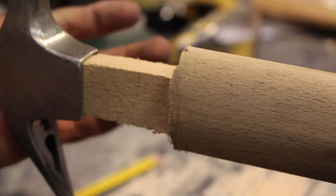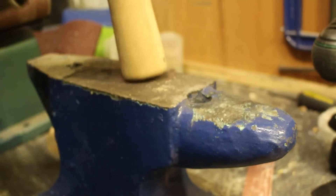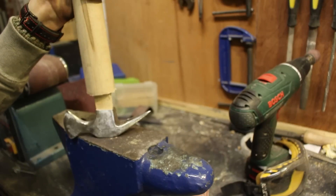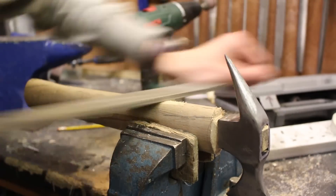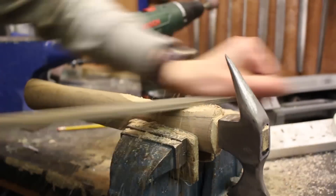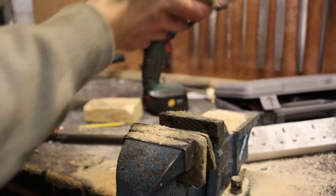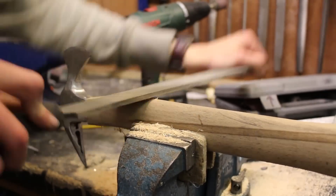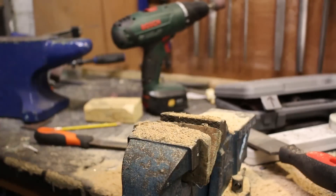I then began to force the hammerhead onto the axe handle. It's a really hard fit — very hard to hammer on — but that's good because it means it's not going to come off easily and there'll be a lot less wobble. Once the top of the handle was as far into the hammerhead as needed, I started to shape the handle to make it much more comfortable, again using the farrier's rasp. I basically just gave it some curves to make it look a little less chunky and to make it fit into my hand better.